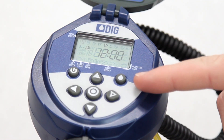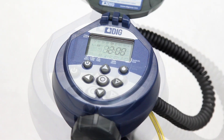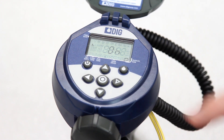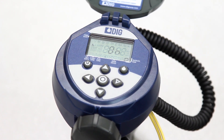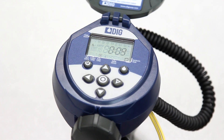The upper right button with the water drop is the manual button. This button is only used to start or stop a manual run. When this button is pressed, the word on will appear. The solenoid will click and the valve should open, pressurizing the irrigation system. After a few seconds, the display will change and show the remaining runtime. To stop the manual run immediately, push the manual button again, or just wait and the timer will close the valve when the runtime is finished.